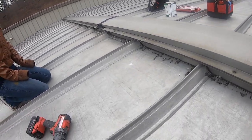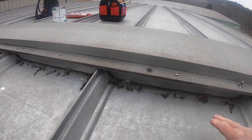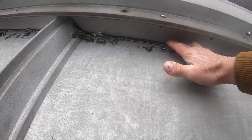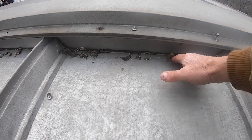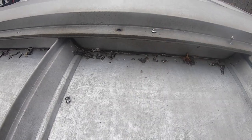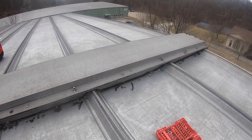Normally these roofs are okay, but most roofs have issues at transitions. So let me show you what the problem is — the transition. When it comes to the peak of this roof, they made this transition here, but this metal roof just goes straight and then they put this goop. You can see this goop, and this goop finally dries up or shrinks and doesn't hold, and then what happens is water can flow underneath that and start leaking. And that's what happened in this case. So water is starting to leak and I'm going to fix this.